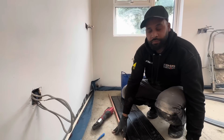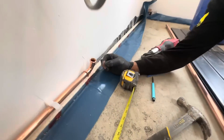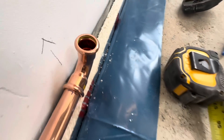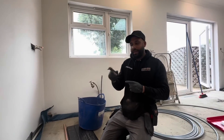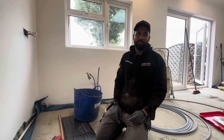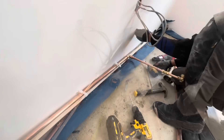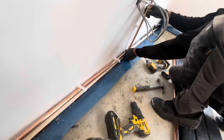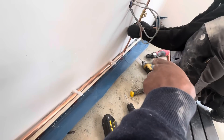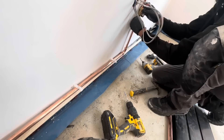So pros and cons — are these fittings more expensive? They are. If you look on the inside of the fitting itself, you'll see a yellow O-ring, and that is for gas. With water fittings it's a black O-ring, but you can get certain fittings suitable for both. They are a lot more expensive than your normal compression fittings. And unlike push-fit, once it's pressed you can't move it — it's a permanent connection.